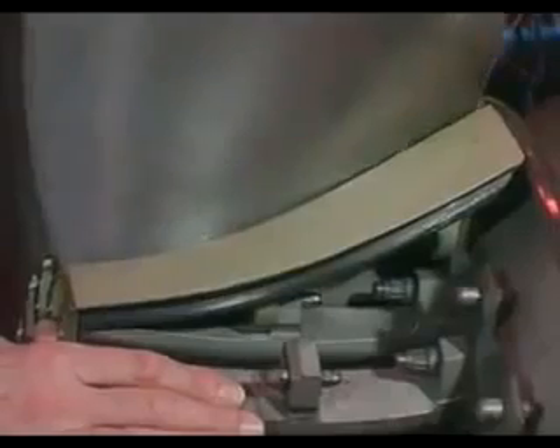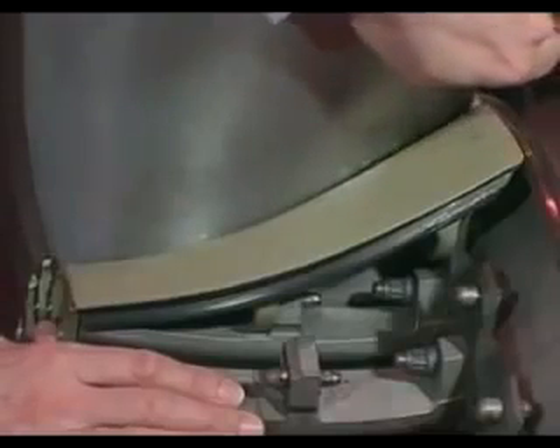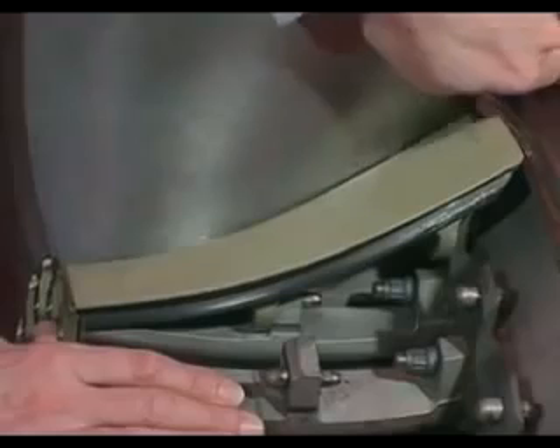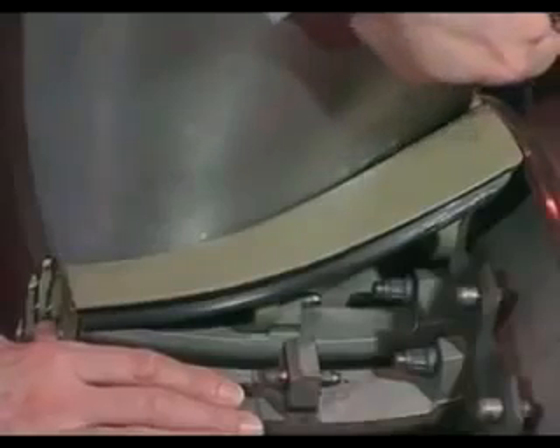As you can see here, lifting the rear of the blade creates a clearance between the blade and the platform, which helps for platform disengagement. Note that the front of the fan blade should stay down during the whole platform removal.